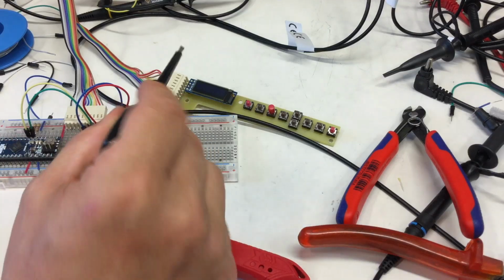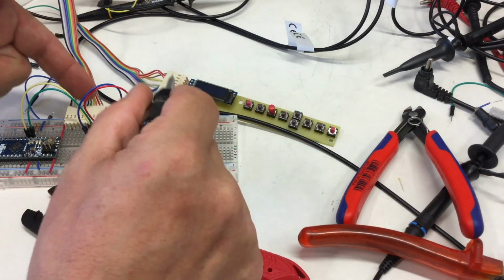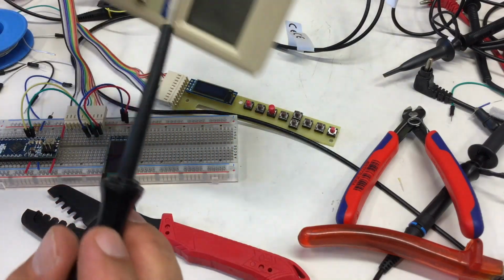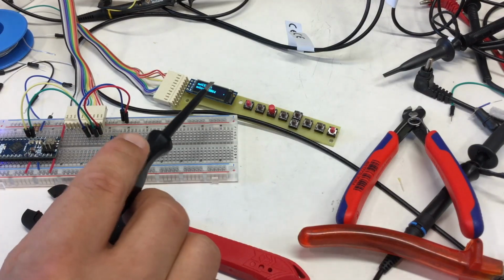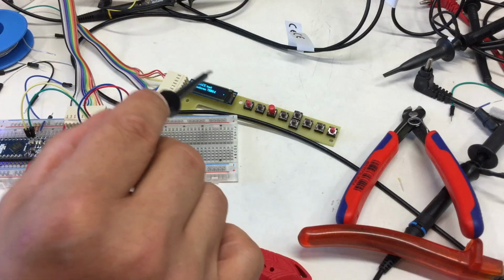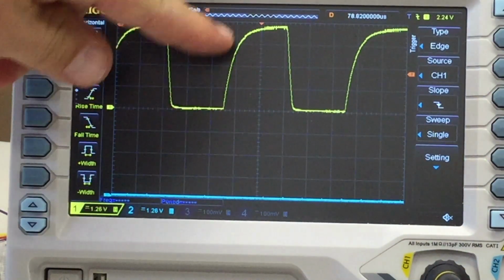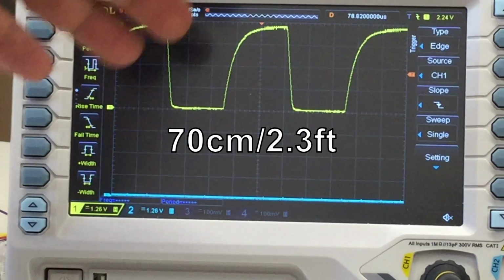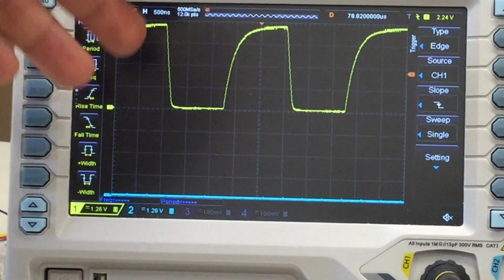Okay, so I basically took the yellow cable out again and took a 50-50 gamble, because from contact to contact there was no connection, and recrimped one side, and then I had a connection. Just with continuity test, and now the display is working. But since we have the oscilloscope out, I still want to measure the signal quality. Okay, I just captured the clock, and as you can see, signal quality is not really worse, even after a good 2 feet, a little over half a meter, 60 centimeters or so, of really shitty connectors and cable.